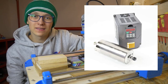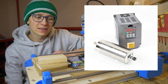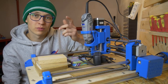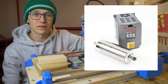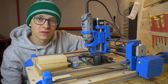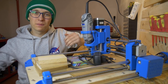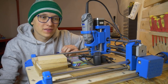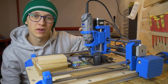There is an even more expensive spindle: the 1.5 kilowatt spindle you can buy from almost any shop in China. It is super powerful — you can machine even steel, aluminum, and of course wood. Machining steel is something huge. But this spindle is very expensive and comes with a dedicated controller that is also very expensive. You can precisely control the RPMs, which is a cool feature. It's a perfect solution if you want to build a huge professional machine. If you are a hobbyist, a Dremel or a Kress is perfect for you. But 1.5 kilowatt — that's a lot of power, about 10 times more powerful than a Dremel.